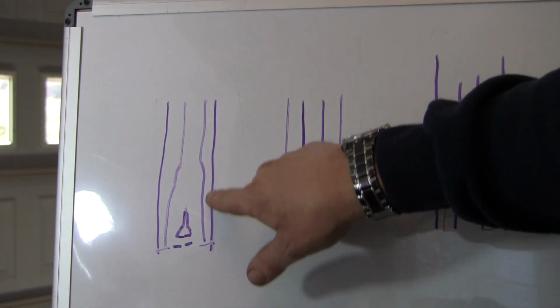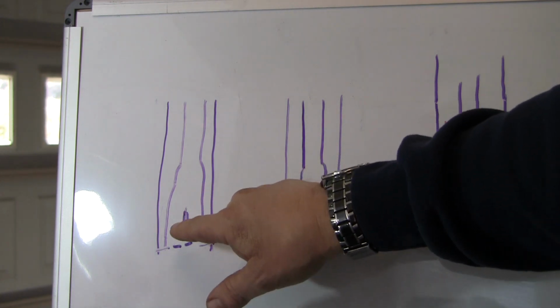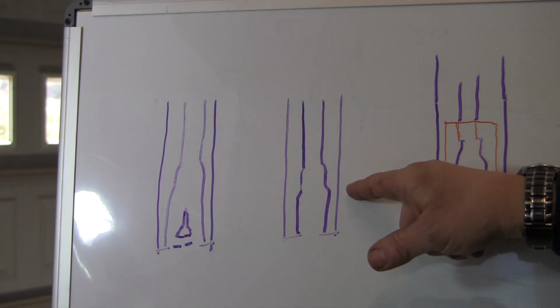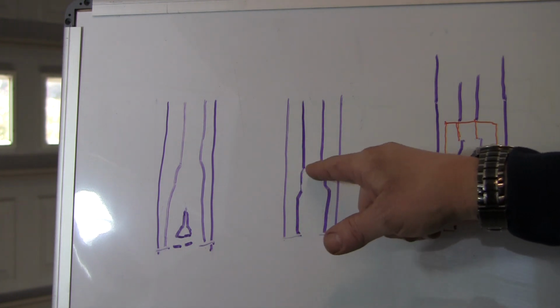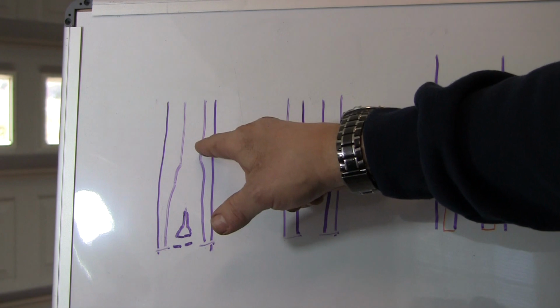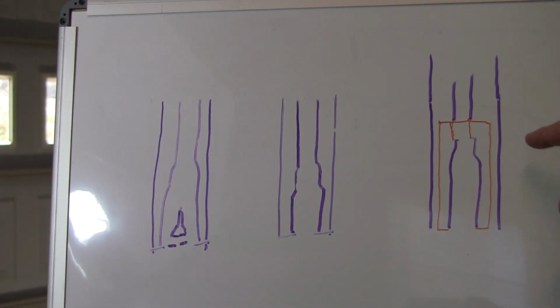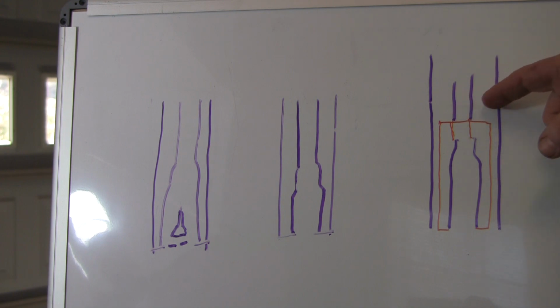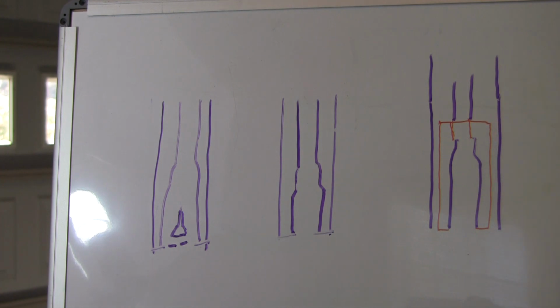This is the Chassepot barrel chamber. There's where that little snout comes in. So this chamber will be longer. This is the Gras chamber. Just a standard barrel, shoulder, come up, you got your little throat area. Well, this distance will be higher than this. So, an exaggeration, the orange shows how they bored out an area. They bored out the old chamber until they hit solid rifling. But it's longer, okay? It's longer by now.